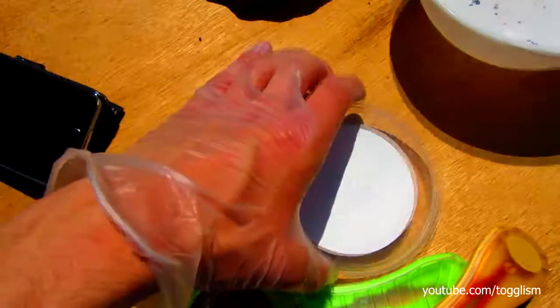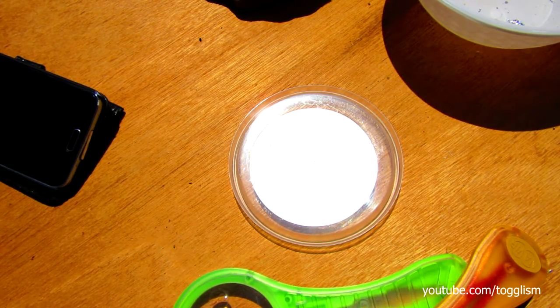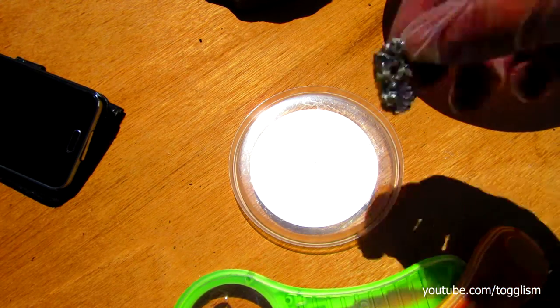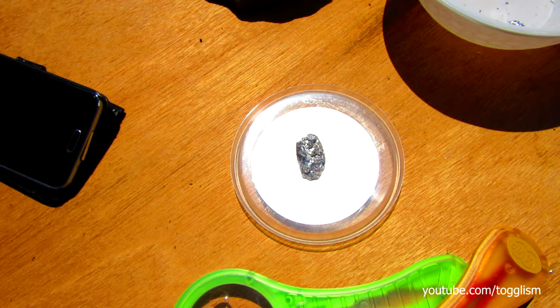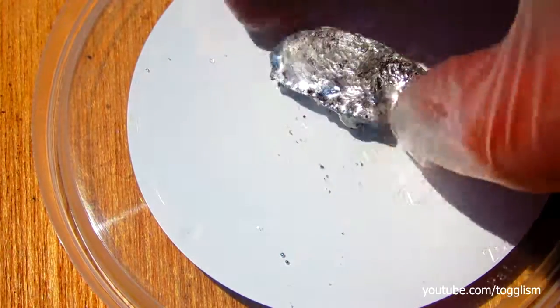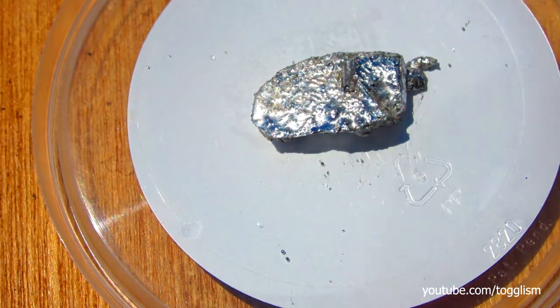To begin with, we'll just try a small amount of gallium — a little bit here that I prepared earlier. One reason why I think it might melt a nice little hole is because of gallium's relatively low thermal conductivity. It has a conductivity value of around 30, compared to other metals such as aluminium, which has a value of almost 200, and silver, which has a value of about 405 — one of the highest conductivity values.